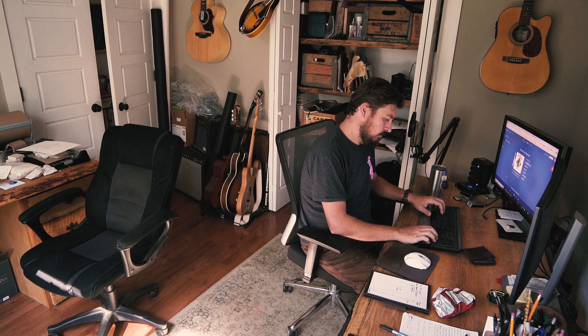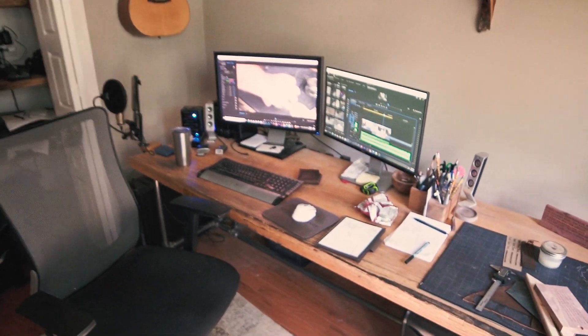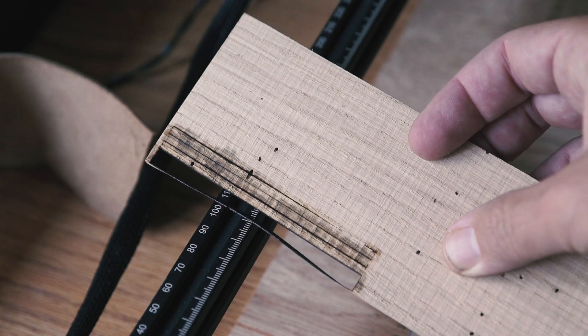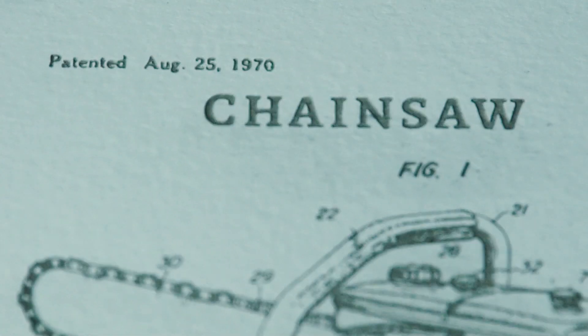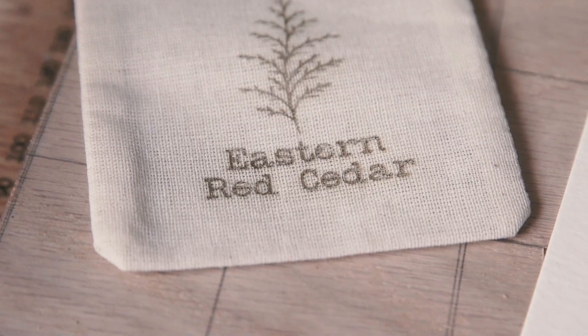I really do love the wireless connectivity of the machine, so I can work on my main computer while the laser is working across the office without having a long USB cord to deal with. I also did a test cutting out small pieces of wood that might be more problematic using bigger wood shop equipment — the test started at 250 millimeters per minute and went up to 1,000 millimeters per minute at 100% power. Probably my favorite experiment was engraving US patent illustrations on heavyweight art paper, and the result was really high-end and nicer than any sort of print, showing texture both in the engraving and the paper itself.